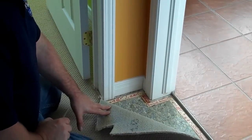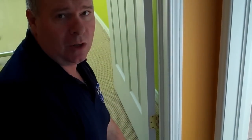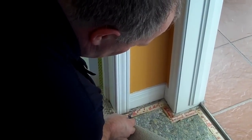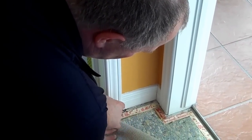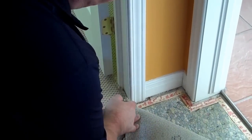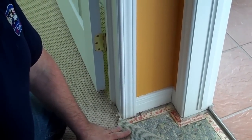In the case of carpeting, for all you finishers and the guys that are installing these doorjambs, what you want to do is see how the baseboard is sitting up about roughly 3/16ths of an inch. A quarter of an inch would be perfect. Around the doorjambs, if you can give me about 3/16ths of an inch, that would be perfect.